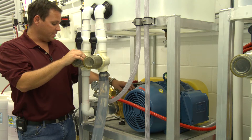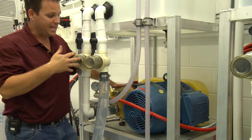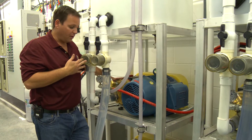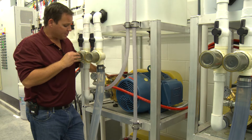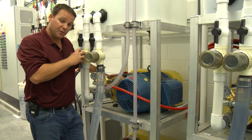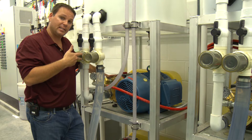With the H25 pump stand, some important things on the pump when it comes to maintenance is daily. Listen for any unusual noises. If you hear any unusual noises coming from the pump, you want to investigate and see where they're coming from. Also, sometimes daily, maybe weekly, is going to be cleaning out this filter right here. It's going to depend on the type of water you're using. If you're using reclaimed water, this could be a daily activity.